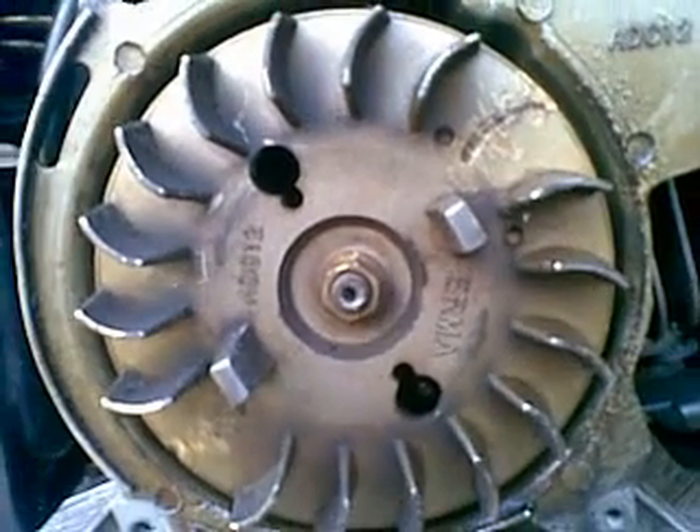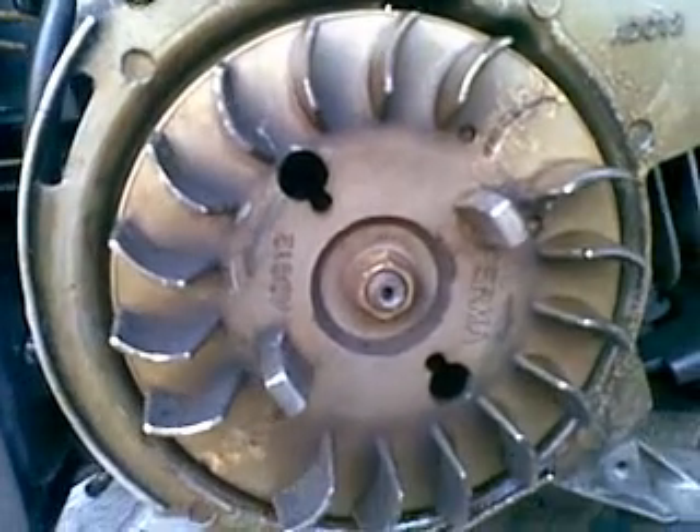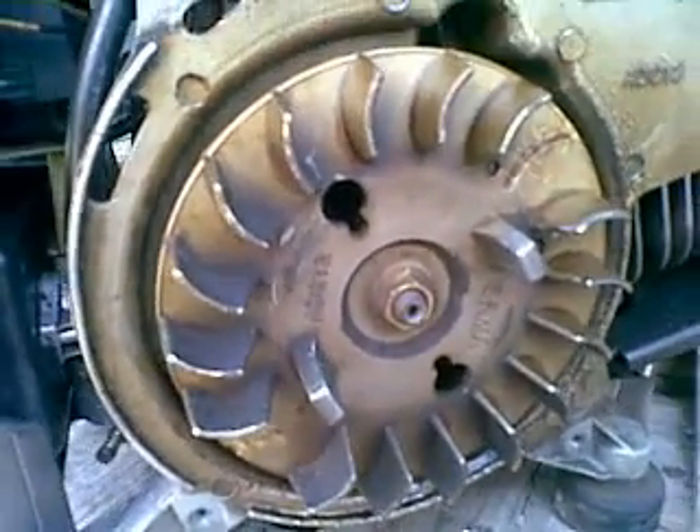Perceptive of you will notice that I've actually removed two flywheel blades to try and cut down the amount of cooling air, because this thing runs too cold. Unless you've got it at full electrical output, it makes too much cooling air. So I took two blades out of the fan many years ago.